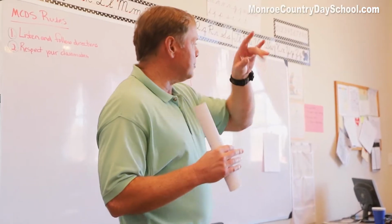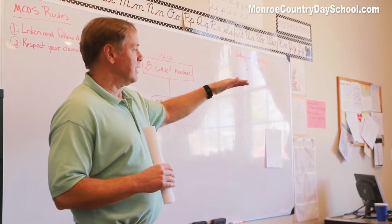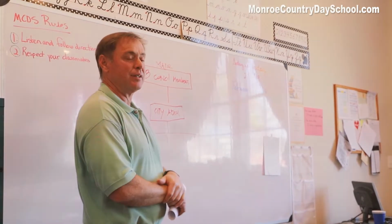What will you do with all the dirt? Some of the dirt you see has been hauled over here because they're going to have to build the finished floor, the elevation of the building, so that it's got to have the right kind of soil that will compact and tighten up for the footings of the building.